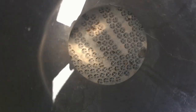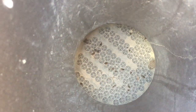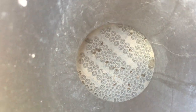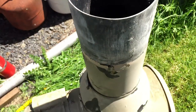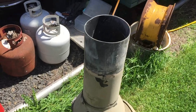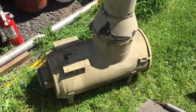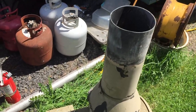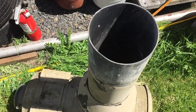This technology is in the aircraft that I used to fly, and it's also in Dyson vacuum cleaners. They're very efficient. We were told that if you're landing in a dusty environment, you keep the RPM up at 100% until the dust cloud dissipates, because the swirl tubes are more efficient when a lot of air is going through them. Then we went to flight idle after the dust cloud dissipated. This is a pretty cool feature in the LMTV.